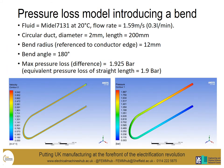We developed a series of CFD models — if anyone wants further information please do contact me. This shows the pressure loss by introducing a bend for the Midel 7131 coolant at 20°C, at 0.3 L/min flow rate, a conductor length of 200mm, and a bend radius of 12mm — the minimum bend radius suggested by the manufacturer. This gives a pressure loss of approximately 1.925 bar; the equivalent straight section gives 1.9 bar. The loss due to introducing the bend is 0.025 bar, which is fairly negligible.